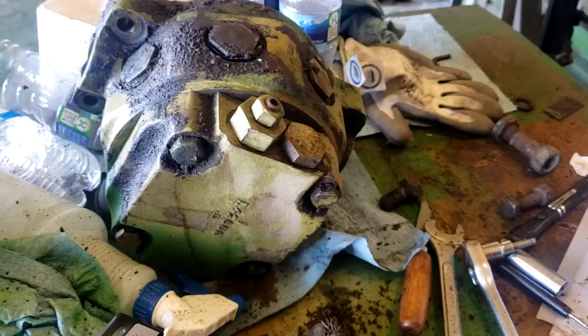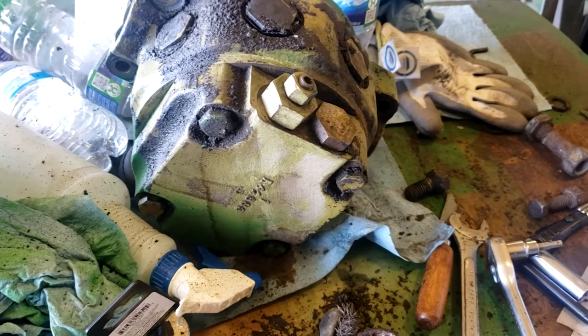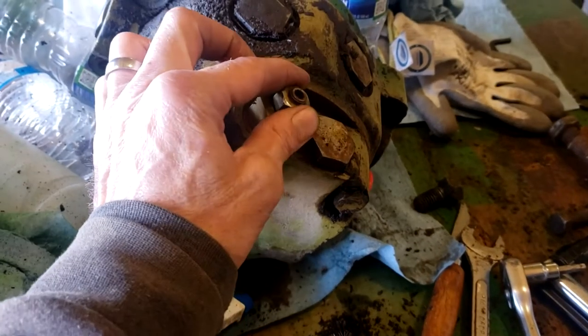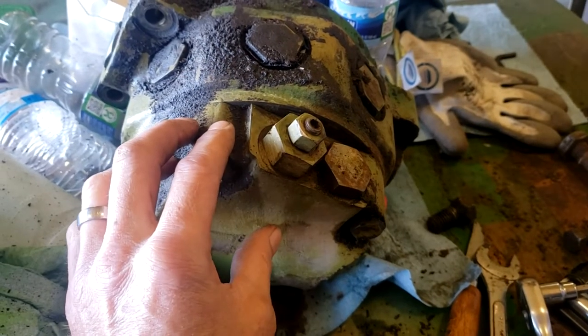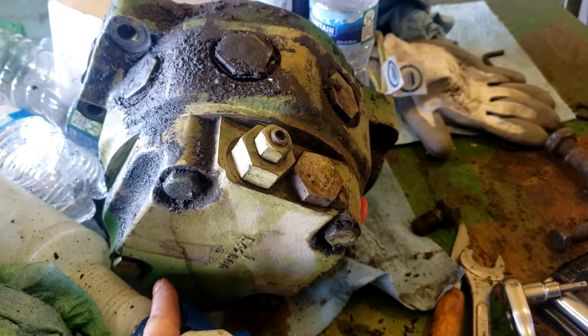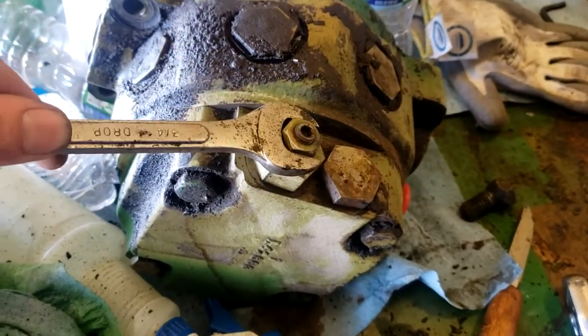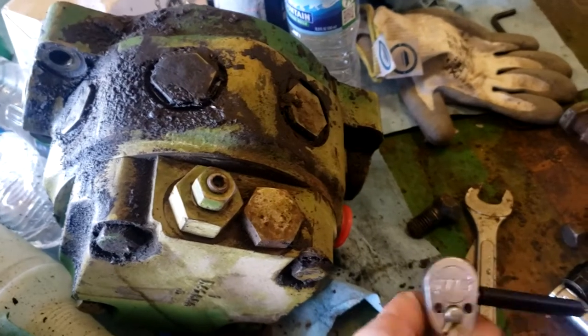Underneath your steering pivot, right there is where that hex screw is, and jam nut. That's where we will be adjusting our hydraulic pressure. If we need to, we're going to check it, but that's where we adjust it, and then up top is the D-stroke and what D-stroke does. Now with D-stroking, essentially what you're doing is you're compressing that spring that's in here behind your pressure setting valve. So like on this pump here, this doesn't have a D-stroke screw on the adjacent side of it. So what you'd have to do, obviously with the motor off, is take a 3/4 inch wrench and crack that loose.